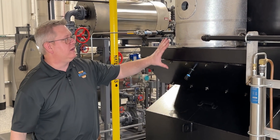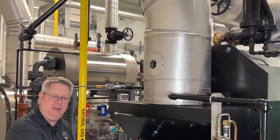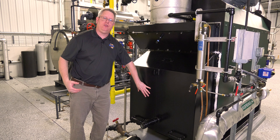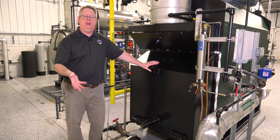I don't want to look at the stack pressure because that's on the other side of the heat exchanger. What I'm trying to measure is the pressure that the fan actually sees, so the back of the furnace is the best place to read it.